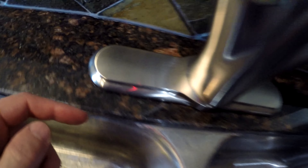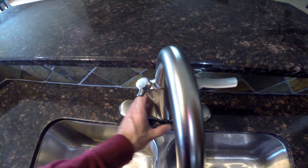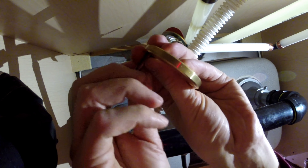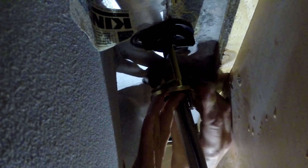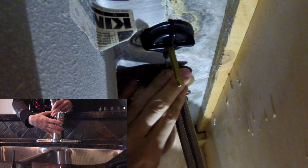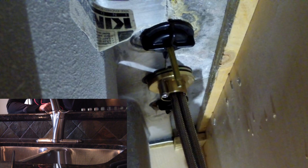Feed the pipes from the new faucet into the center hole and lay the faucet in place. This is why they recommend the faucet be installed in a corner — it has to be on a bit of an angle. I don't know if I like that overhang. If the base is aligned so that the levers are the same distance from the sink, a small gap appears on the left-hand side. So let's get it turned and install it on an angle.